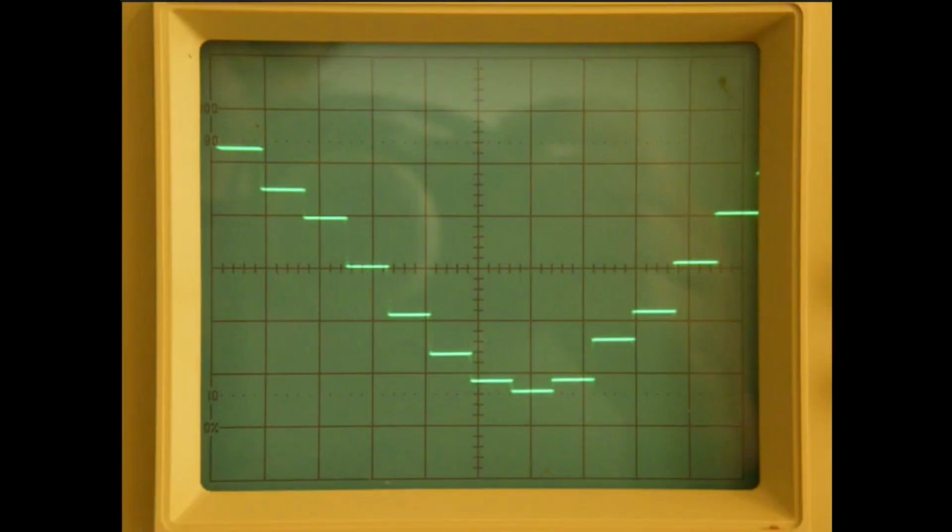There are a number of ways that an oscilloscope can show the phase relationship between signals, and I've chosen this particular one. What we're looking at here is part of a wave of phase 1 output before it enters the LM324 first order filter. It offers sharp edge precision timing information, and this I can use for synchronization.